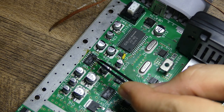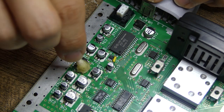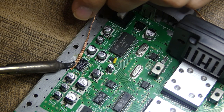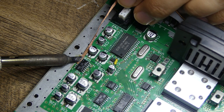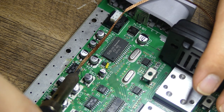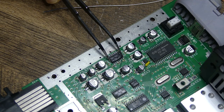Sparing you a lot of time and detail, all tests for shorts on the caps are negative. Tests for continuity are excellent. Voltages across capacitors are what they're expected to be, and voltages supplying U1 and U2 are solid. U2 may be bad, though pins 7 and 8 have voltages off them suggesting a signal, so I decided to remove and bypass U2. I managed to get the little guy off, connect pin 3 to pin 7, connect pin 12 to pin 8, and nothing changed.